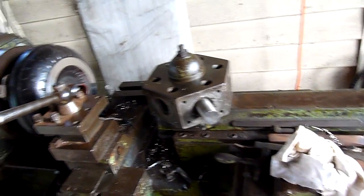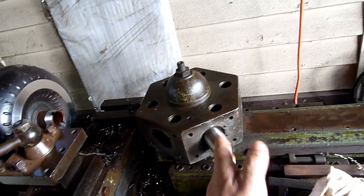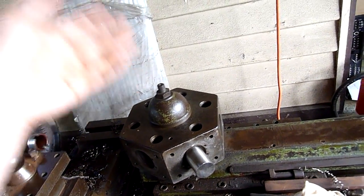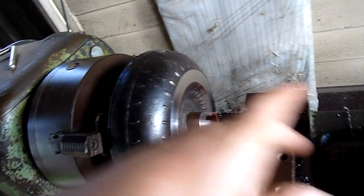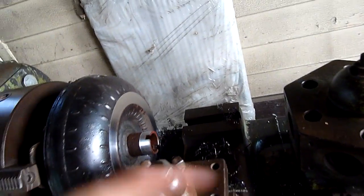As you can see, you've got a multi-station tailstock turret — like your drill, your reamer, your countersink, your tap, or whatever. You can mount your parting off tool here, your turning tool here, do your turning profile, bring it back, and part it off after your drilling operation. And that's about it.